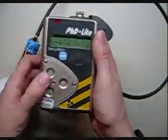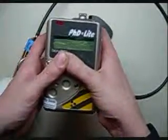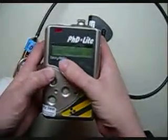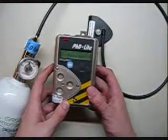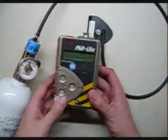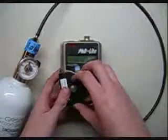In order to start the instrument calibrating, take the button and hit it three times. It's going to do a countdown — hit it again. Now it's doing a zero calibration. What will happen next is it's going to come up and give us a prompt for the actual span calibration — that's this one right here. We're going to click the button and put on our cal cup.